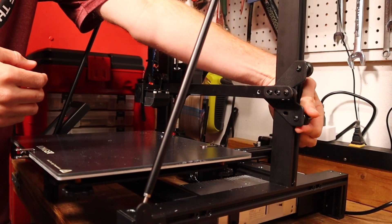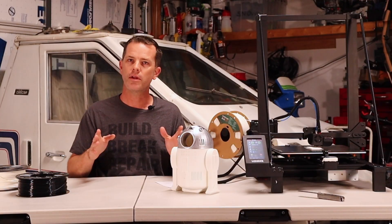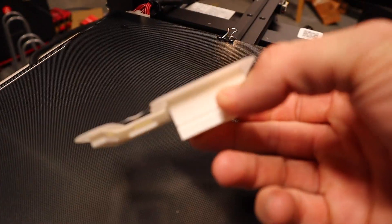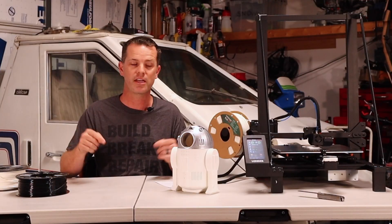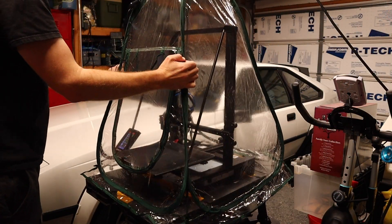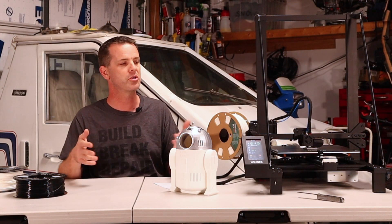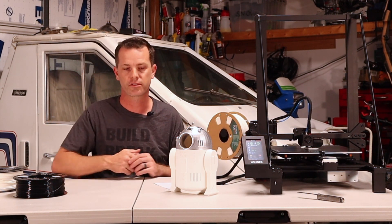It's also a good idea to check every other wheel on the printer for correct tension, as any looseness will cause wobble and affect your print. Another issue I ran into is the ductwork for the cooling fan — it's really not that great. In PLA you need that cooling fan running well, and it only cools from one side. There are a couple of replacement files on Thingiverse I'll link below. Also, if you put this printer in an enclosure for ABS printing, all the components including the screen are part of the frame, so they get trapped in the heat — it would be nicer if they were easily removable.